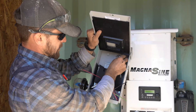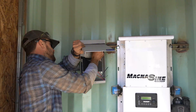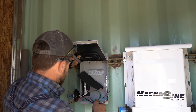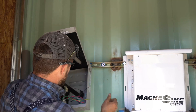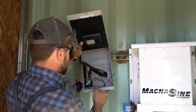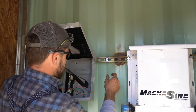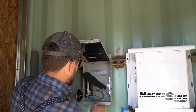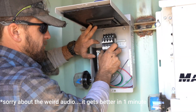You can see the holes on the back top of the combiner box — you'll thread it through there. This combiner box takes your PV wires from the solar array and transmits that power to the inverter. It also serves as a disconnect point, so if there's an issue with the solar panels it can trip here before hitting your other hardware. Since the inverter is about eight to ten thousand dollars, it's nice to have that protection. We're now installing the breakers for our PV wires to run up to the solar panels.